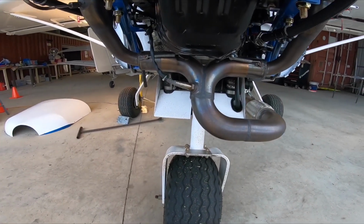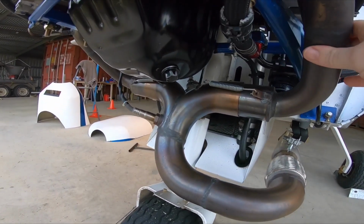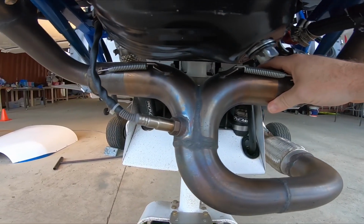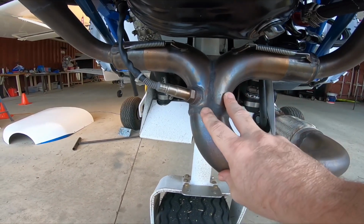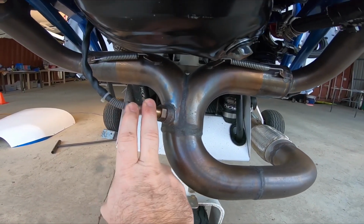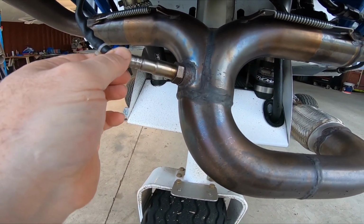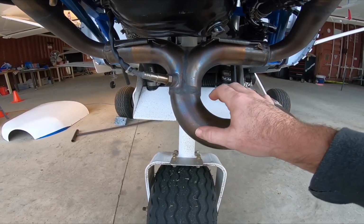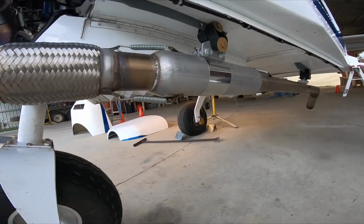The exhaust is a super high flow exhaust. I've made this up with 1.25" runners going into a 2.5" pipe. I put these spring slip joints through. It goes into this T-merge collector here, which was just made up out of 2 right angle bends. This here is the wideband O2 sensor, which goes into the SDS controller, which tells me air fuel ratios of the engine in real time. Then I've just got the exhaust running out down the side and into a hot dog muffler there.